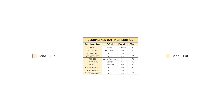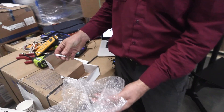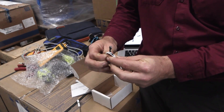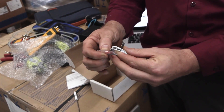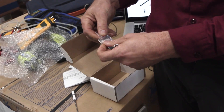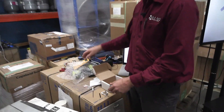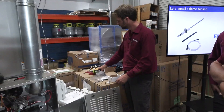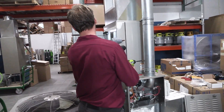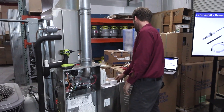No change needed is shown in green, or we need to bend it shown in blue. So we have our flame rod and the wire that comes with it. The connection points are typical sizes, and they also have a backup smaller spade, a screw for securing it, and a shield for if you need to modify it — bending it, whatever you need to do, you can slide the shield over that. So let's go ahead — I'm going to power down and walk through this so you can have this on your truck, check out the part number on the old one, and match up to what needs to be done.